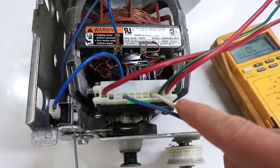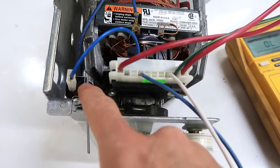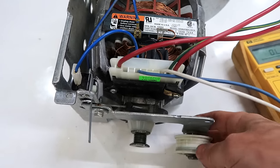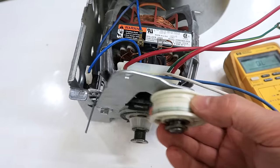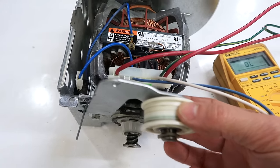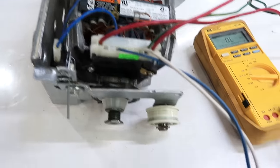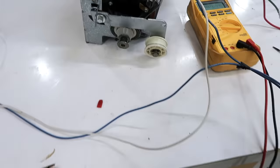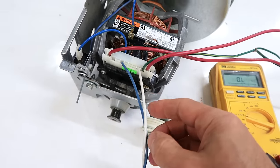That just leaves the white and the blue wires. The blue wire goes through this switch and then to the motor — that switch is here. If the idler pulley used to have a spring on it and the belt came off, it would hit that switch and shut everything off to protect against the main belt breaking. And that blue wire goes to another set of connectors, which was probably some other safety switch. So I'm pretty sure that's one side of power, and white has to be the other side.